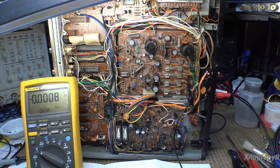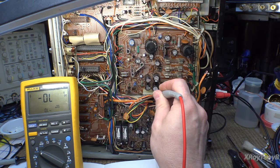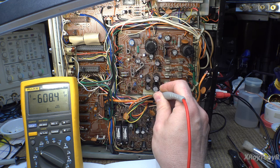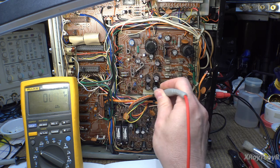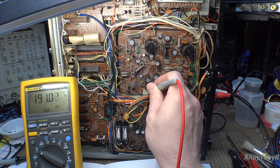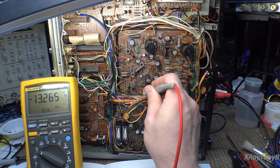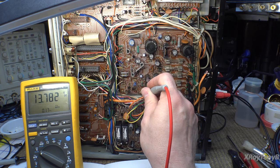Let's hope our fuses don't blow again — here we go, full power. According to our little reader, we have 259 milliamps of current draw for the entire receiver, which sounds reasonable. Our high voltage is now 600 volts — negative 600 — so that's pretty much where they wanted it. The 240 volts is still a little low, but negative 13 is negative 13 and positive 13 is positive 13, so that's good.